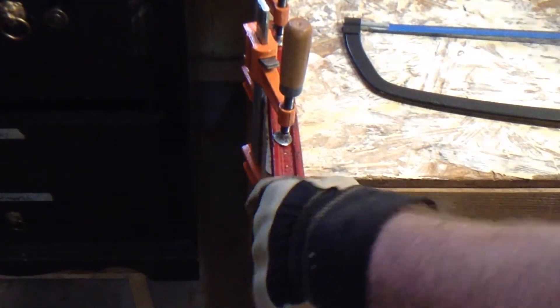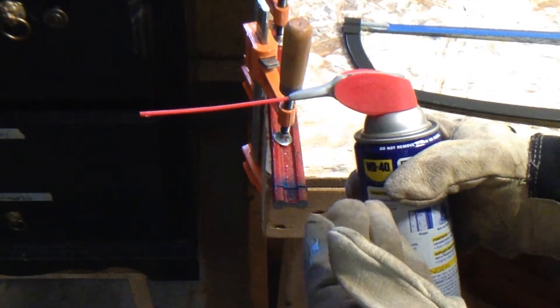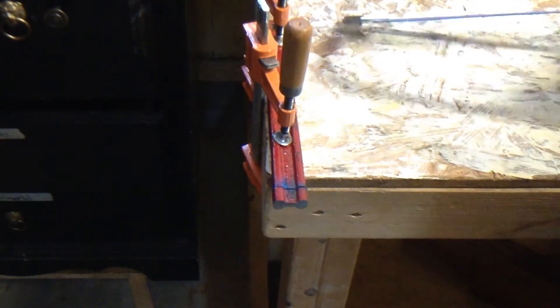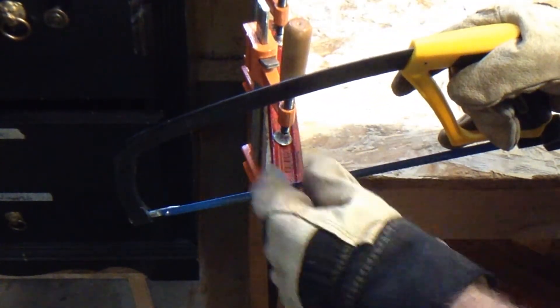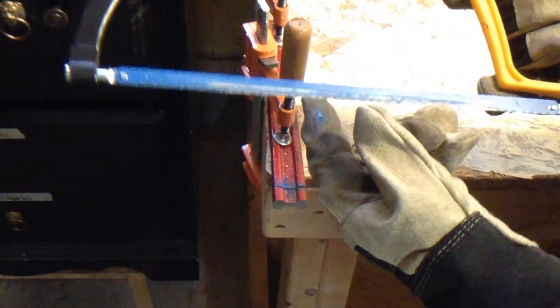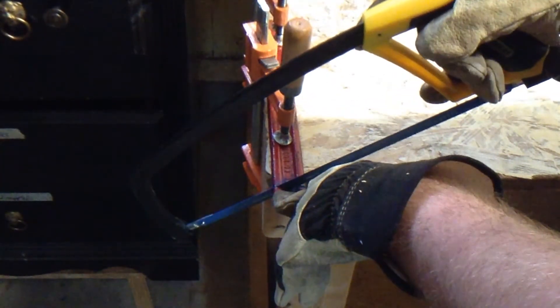A great little trick if you're cutting a thick piece of steel — you don't really need to on thin pieces, but on aluminum and brass, a little WD-40 on each side of the blade every now and then helps quite a bit. And if you notice, when I'm cutting I'm changing my angles so this cut doesn't get too wide and it's able to clear the chips out easily with the angle of the teeth. So keep changing your angle and it'll go a lot faster.